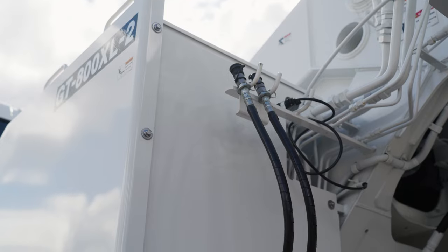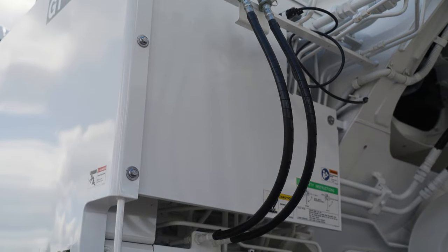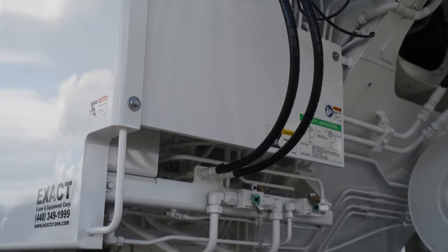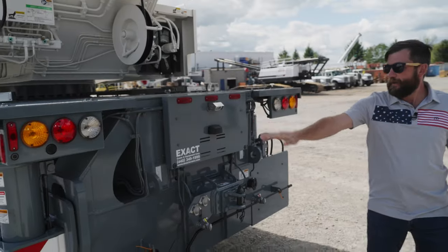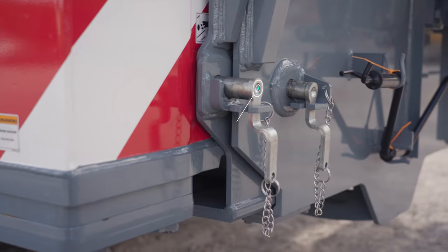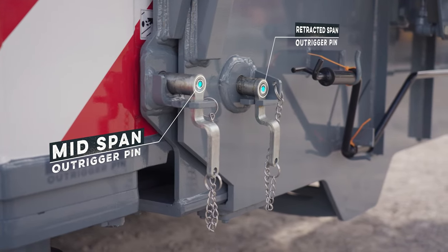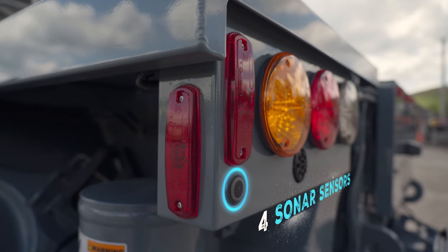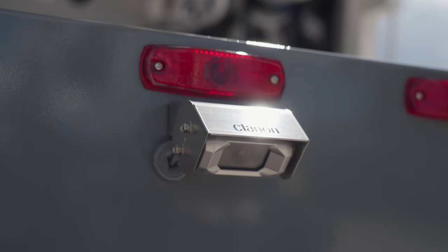We'll go ahead and start off with the two hoses for your counterweight cylinders that are currently stored on the deck up front — we'll talk about those in a second. You've got your two valves for your boom dolly mode there. Down here, you have pins for mid and retracted span outriggers. Coming across the back, you have four sonar sensors and also a backup camera with the display in the cab.